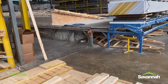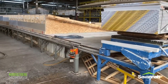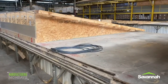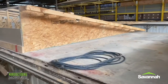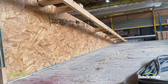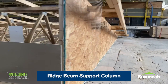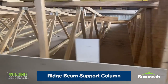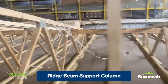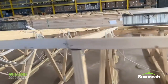If this home has a large span going from one side of the home to the other through the marriage wall, then the roof must be supported by a beam along the ridge of the roof. Since there's no wall, a strong beam has to be engineered that will not allow the roof to sag in the area of the open room. This beam is also supported by structures within the wall called the ridge beam support column. There are generally three or more studs connected together found on each end of the open span at the marriage wall. The ridge beam is like a bridge, and these columns support the ends of the bridge.